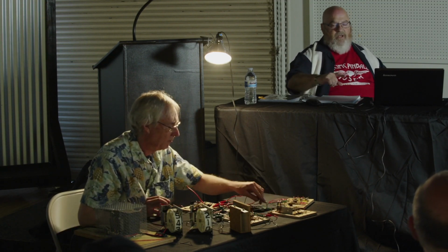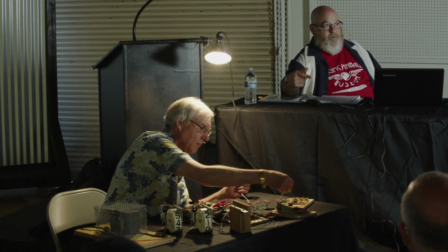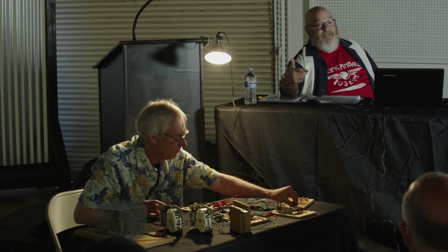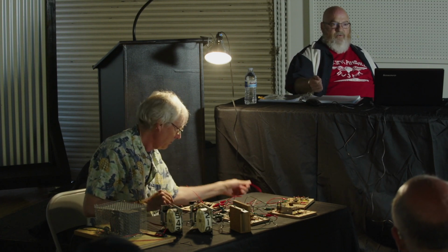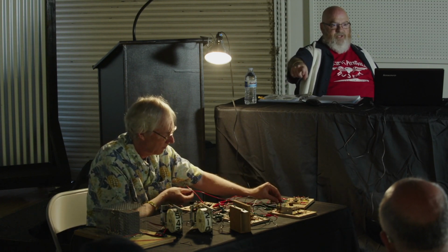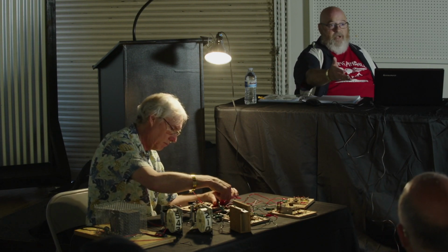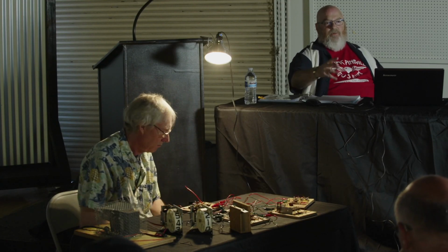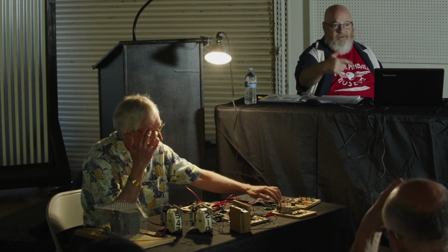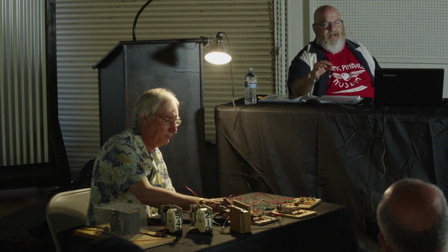In that situation, the highest denomination relay, along with the current player's highest denomination reel, has a 9 switch. When it advances that relay, it uses a switch, just like it would for carryover, through the 9 switch, and it just turns on the 100,000 relay. The 100,000 relay has multiple switches. One is going to turn the 100,000 light on.